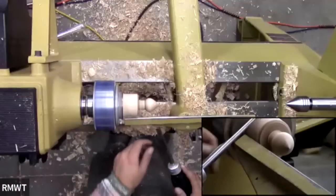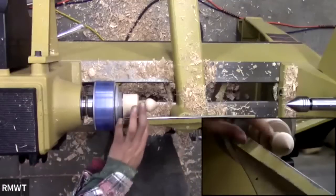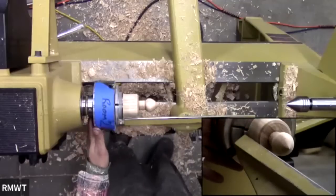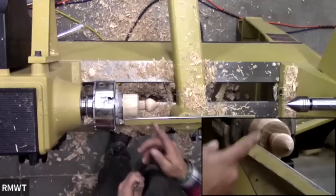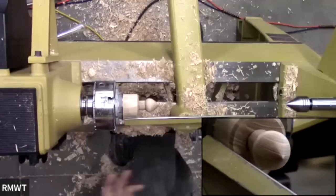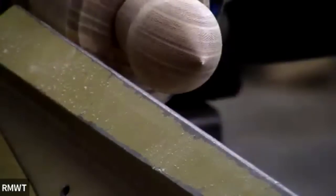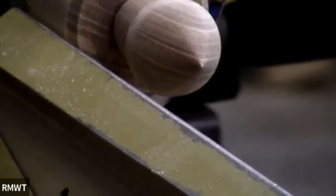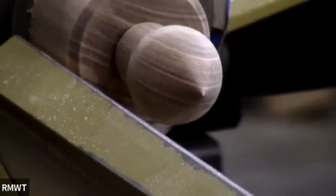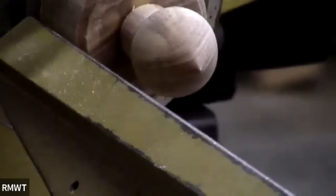But this also highlights a good area for us to be able to see what's going on in the end grain. So this area is really clean. This area is cleaned up really nicely. And that's pretty clean straight off the tool. What we want to see on this end grain, if you can cut the end grain of elm very clean, as I see it, you're doing pretty good. And even more so if you have kind of spalted material. It's nice to see how spalted the material you can get and how clean you can actually cut it with a skew. I like to play around with things like that if I'm practicing, not actually doing piecework.